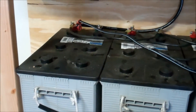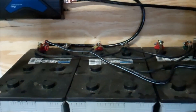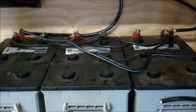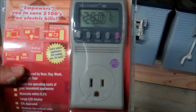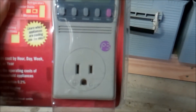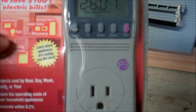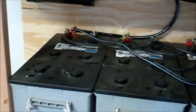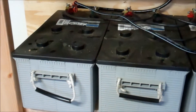Refrigerators now are so efficient. If you have an old refrigerator and want to do solar or battery backup, buy a Kill-a-Watt meter. You plug it in and it tells you how many watts and amps the appliance is using, plus kilowatt-hours over time, and you can see startup draw versus steady-state. His new refrigerator won't even put a dent in these batteries. After that he just needs to run a few fans, some lights, and — got to have the big screen TV.